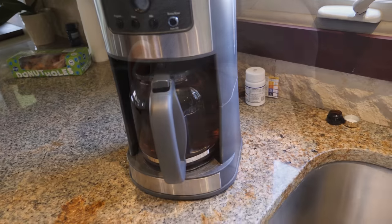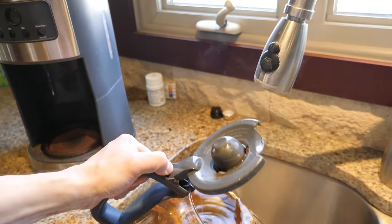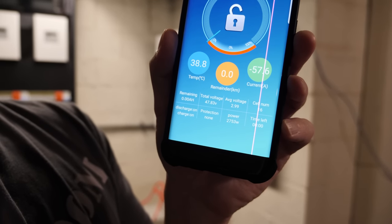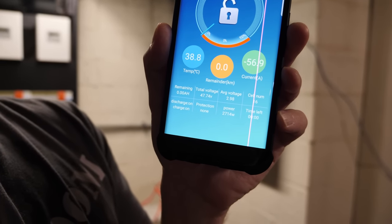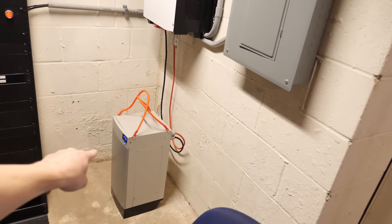Coffee is done — that's two full pots while running everything else. I walked around the house: 52 lights on, dishwasher on, two refrigerators on — no problem at all. We're drawing 57 amps, battery voltage is 47.82. It's just doing damn good. How do they squeeze that much power into that thing?